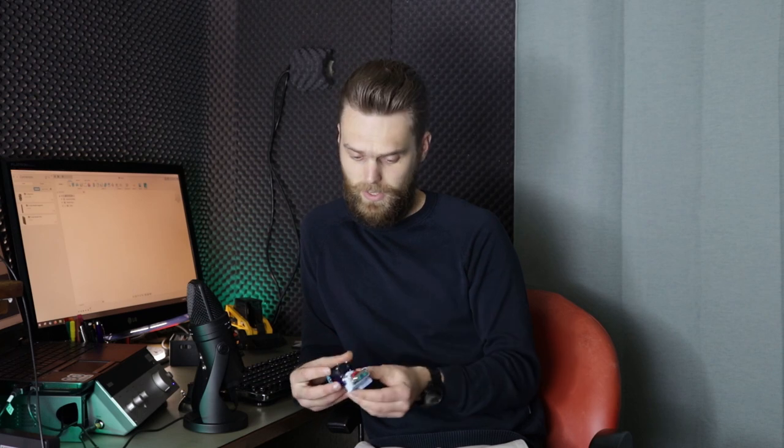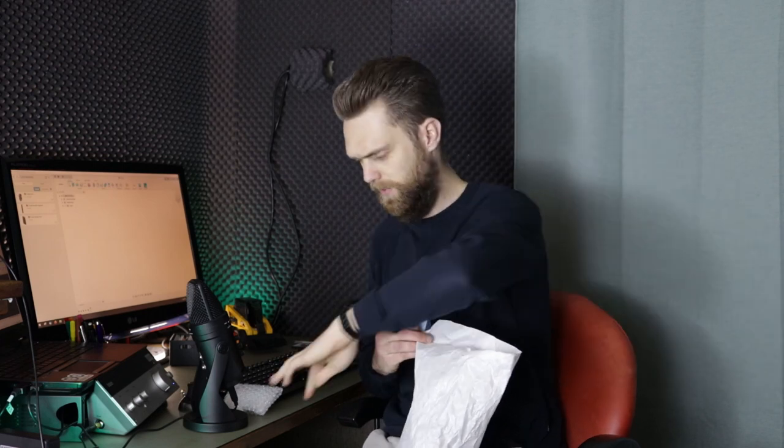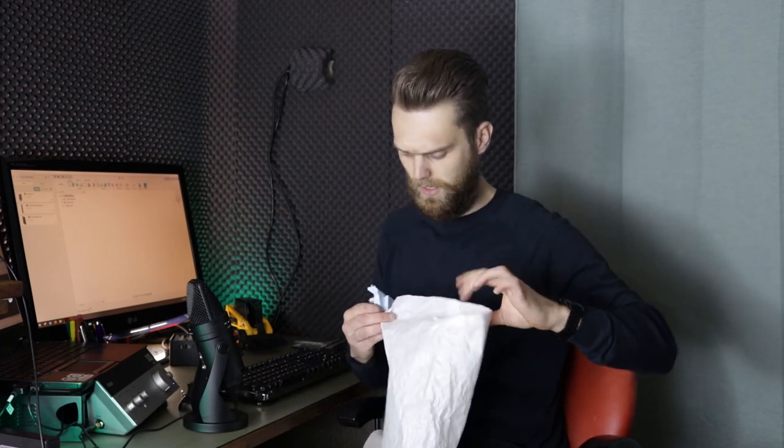The reason I'm doing this is because of the swappable hotend I designed earlier — there are some issues with it. One of the biggest issues is the connector itself. It turns out that this special D-sub connector, or mixed D-sub connector, is a bit hard to get. I managed to get a couple of them, but they are pretty difficult to find and they are expensive. So I'm going to try to create my own custom connector if it works.